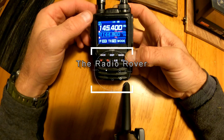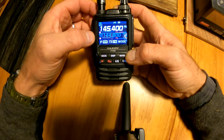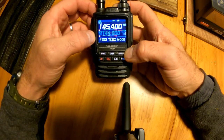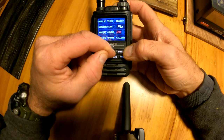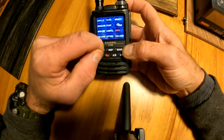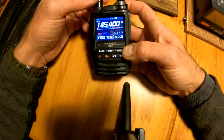Just a little bit about this Yaesu FT3D before I get into the ins and outs of the antenna. A couple of handy features on this radio. One is the APRS function, which will transmit and receive APRS packets. Now when I'm activating the summit, I don't want the APRS enabled because the various transmissions would interrupt either my receiver or my transmit on the other frequency. So I go down and I turn the APRS modem off, and so that I'm not receiving other packets from other stations, I flick and hold the A-B button, so I'm just on a single receive frequency.